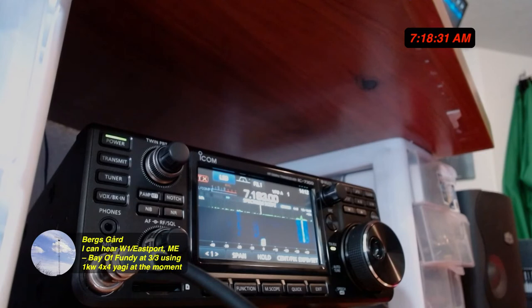I got you. See, when you work Grayline, let me explain this the best way I can. Grayline is a time where wherever the sun is coming up is where your signals come in first from. Look at it that way. If you ever look straight east or straight west, right at the beginning of winter or the beginning of summer, you'll notice when the sun's coming up, it appears from the north or the south, depending upon the time of year, right?